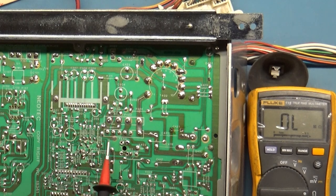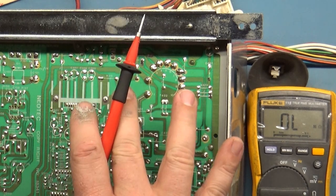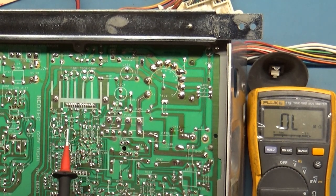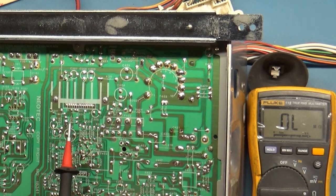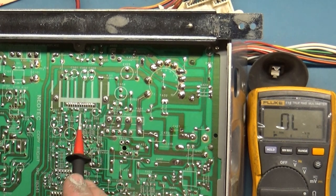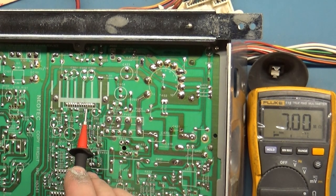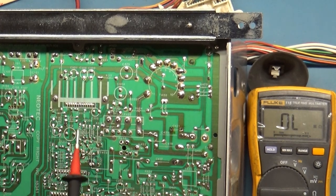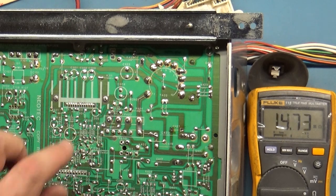You know, I do have a working one of these in my multi-Mortal Kombat machine, right over here on my right shoulder. I may pull it out to get a good reference chassis for testing, because I'm skeptical whether this one would become a parts chassis as well because of vertical collapse. It's very likely. Pin 5 is definitely not open internally because it's got a line going right to a capacitor. So it's possible my donor chassis also has collapse, and it could be the same two bad pins.